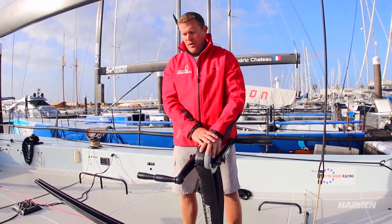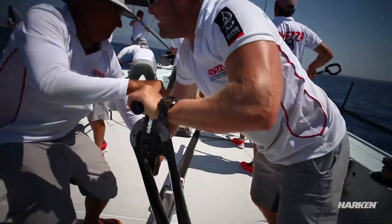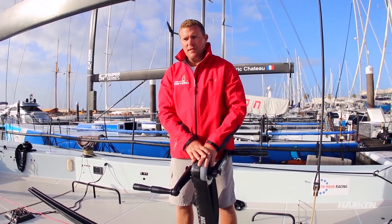The drop system in a 52 is a device designed to drop the spinnaker down really quickly without the need to have guys standing on the bow of the boat. Primarily as we come into the bottom mark, the back pedestal links to the front pedestal so you get maximum horsepower in the drop. Downstairs links onto its own drop wheel, and basically we spin as hard and as fast as we can — down comes the kite.